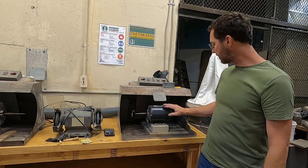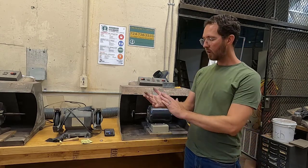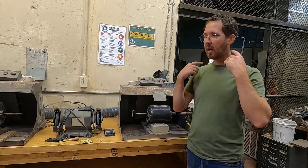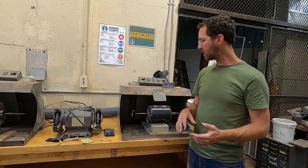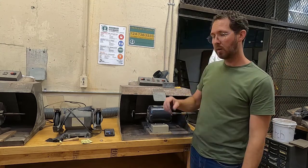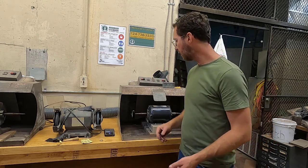There are some serious safety concerns with this particular tool. Number one, always wear eye protection. Number two, no dangly anything, okay? No loose jewelry, neckties, headphones with cords, none of that. Pull your hair back. Where I went to graduate school, there was a picture of a person who had a bald spot because she had a big chunk of hair ripped out and it does not grow back.